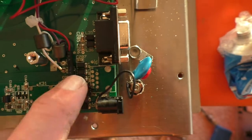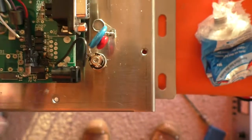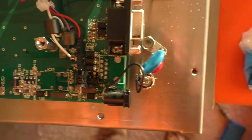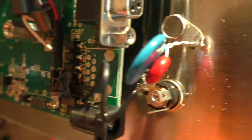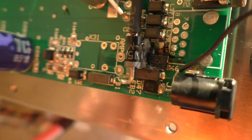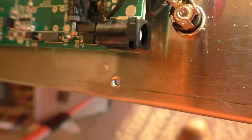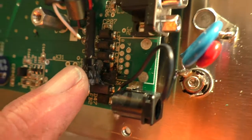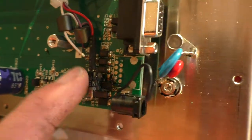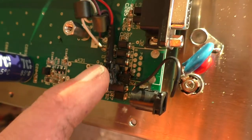It's got a little bit of heat shrink there where I've joined it. And just to give it a bit of mechanical strength, under that diode there's a bit of silicon rubber just so that it's quite firmly mounted — because when the relays clack around there's going to be a bit of vibration going through the board, so that will give it a bit of mechanical strength.